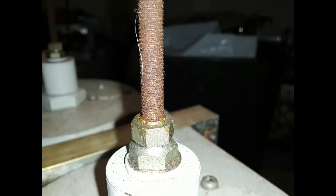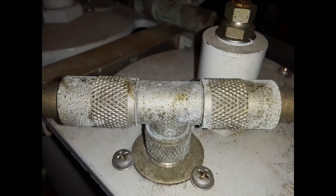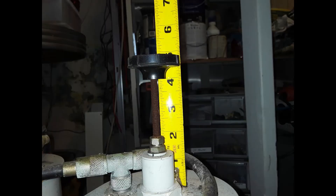The bandpass adjusting screws on the top were terribly rusted and the coax connections were a bluish-green corroded mess. This is primarily a disconnection and cleaning video rather than a major disassembly with a blowtorch like I needed to do on the 440 duplexers. This one is going to primarily need a heavy-duty cleaning and I'm going to try electrolysis to remove the rust.